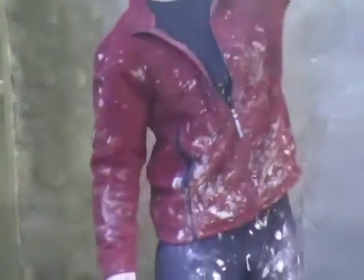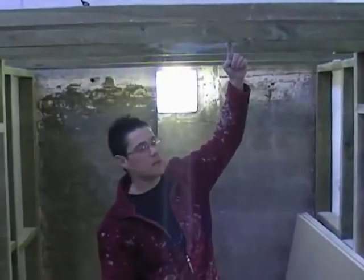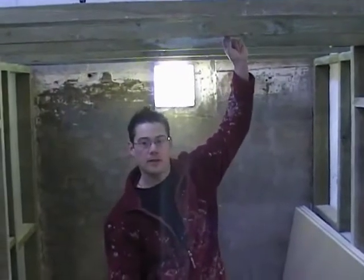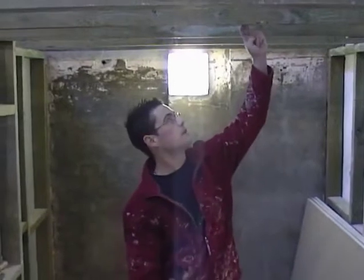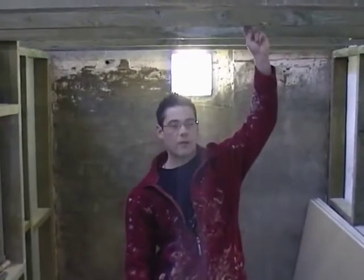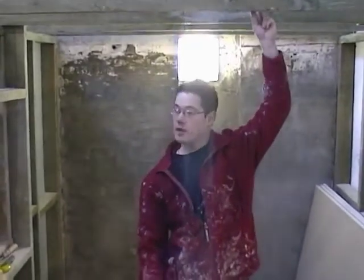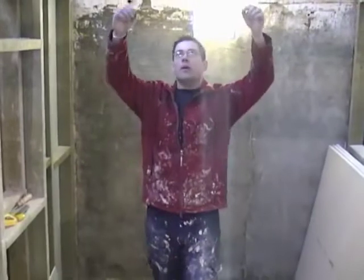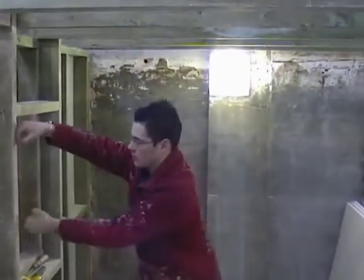I want to make sure, if it's neat as possible, I want to drive them home as nice and neat and flush as possible. If I see any nails hanging out, I want them back flush. The reason being, when you come to plaster, if you've got nails sticking out, it's going to cause all sorts of problems — so make sure they're fitted nice and neat as close as possible. And make sure every nail is on a joist, spaced 12 to 14 inches apart, on the course as well.